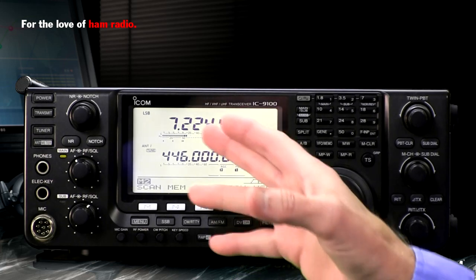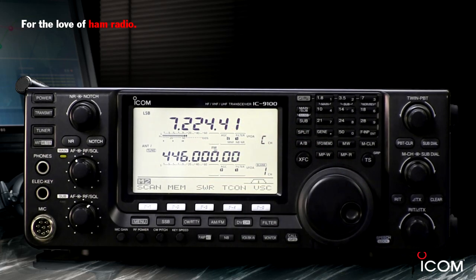And the AGC loop management function is built in the DSP as well. This allows you to get better receive signals with less interference. And there's digital IF filters that allow you to build your own filter. You can choose a bandwidth, shape, and center frequency so that you can hear that rare DX station.